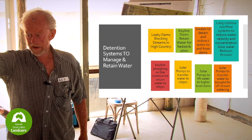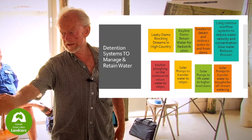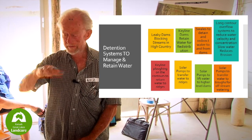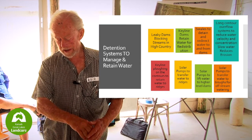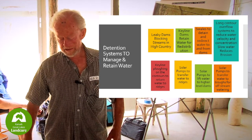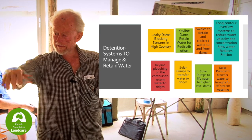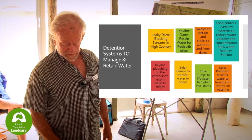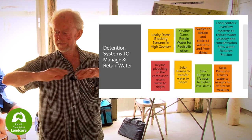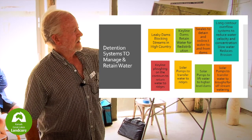Long contour overflows reduce water velocity and concentration to slow the water down. I've got a classic example of that on the overflow of the big dam — I had five goes at fixing that overflow because when that dam fills it comes down hard. I had to put an overflow about 500 metres long around the contour. I dug with the excavator two metres by two metres in the overflow, the downhill side cut on the contour, all the spoil thrown on the uphill side with gaps for the water to get through. When the overflow works, it goes over that edge and spreads right along the landscape and filters into the ground. Where I had bare clay and carpet grass, it's now chock-a-block with broadleaf paspalum under those trees — self-seeded, just there because the water's there.